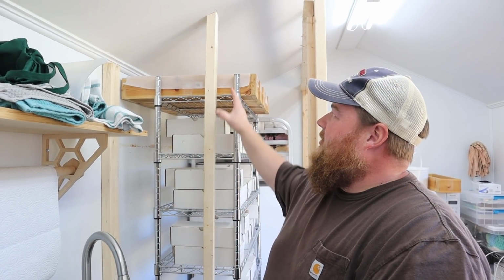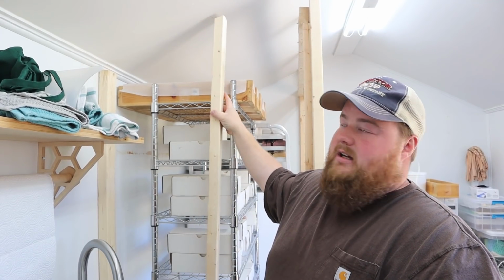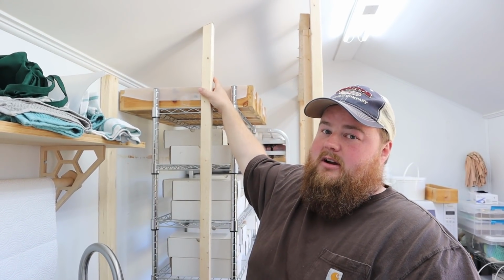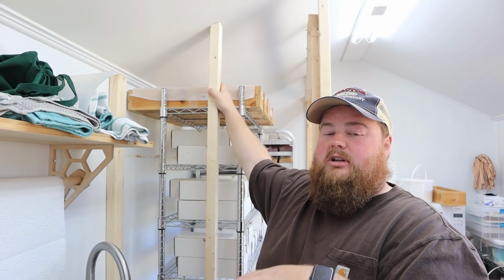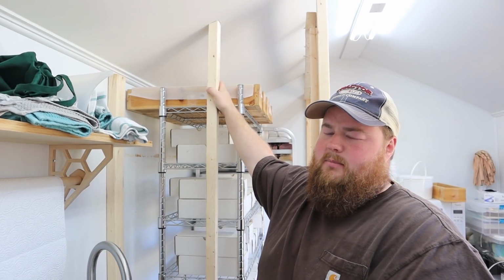Anyway, so what I've just done is make a mark here on the ceiling, which is the reference point for this stud. There is not a roof rafter or joist above this paneling for me to attach this to very well. So what is going to hold this into place is basically a couple of screws, tack it into the wood paneling that this shed was finished with, and then it's going to be attached well on the bottom.